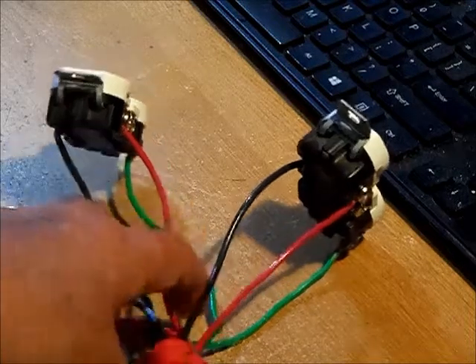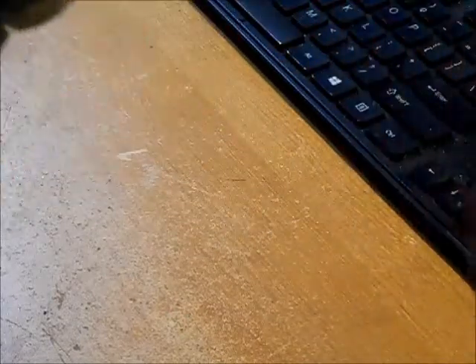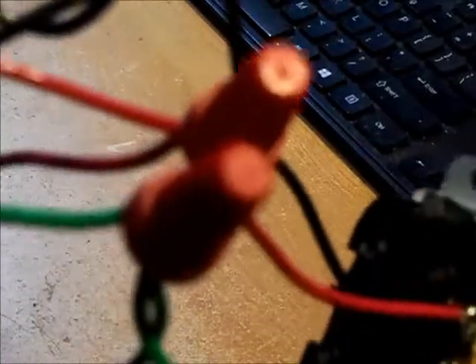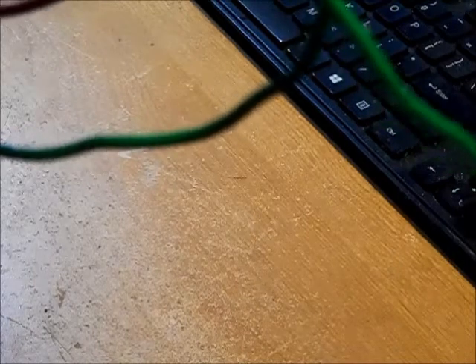Alright, part two. Obviously I'm running setup for a 120 circuit. Remember, I'm letting the red wire represent what would normally be your white insulated wire — I just did not have any white scrap wire. This is the proper way to wire circuits up: you have your hot leads, your neutral, and your ground coming in from your main source, then you wire-nut them together so that each individual outlet only handles the load on what is actually plugged into it. The way it was wired, the first outlet was handling the load for every outlet down the line — and that's an open invitation to a meltdown.